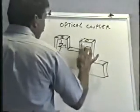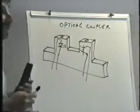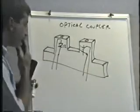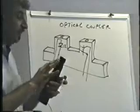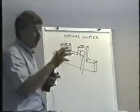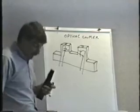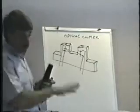This is a phototransistor, and it works with light shined on it. When light is shined on it, instead of putting voltage on the base you just shine a light on it — it's just like an electric eye. You walk in a liquor store, you break the beam, the bell goes off — same kind of thing. We use these a lot in games: steering wheels, trackballs, accelerator pedals, gear shifts — they're all over the place.